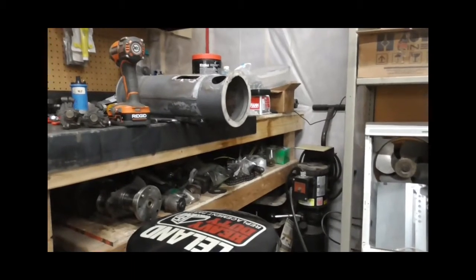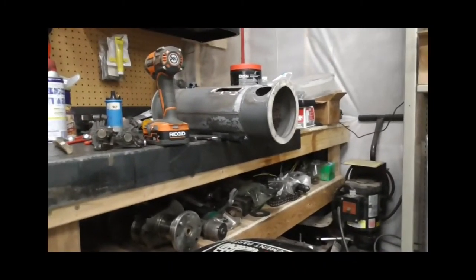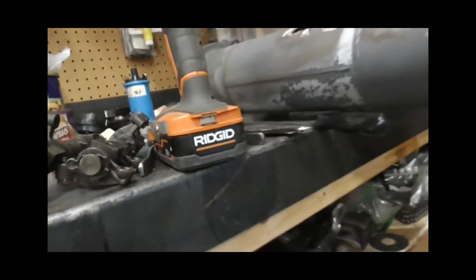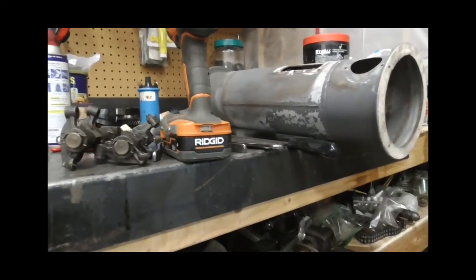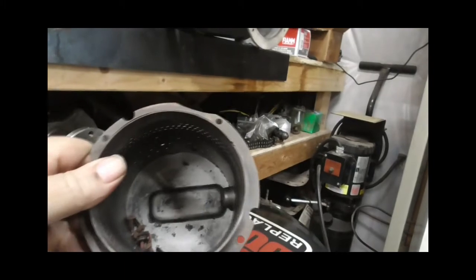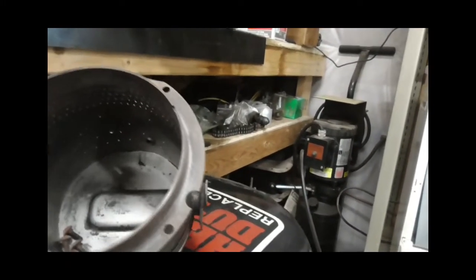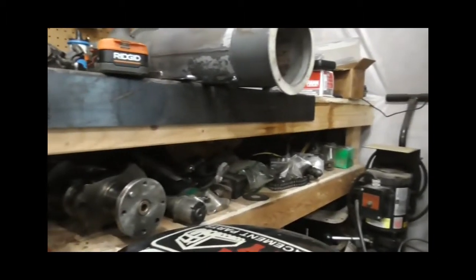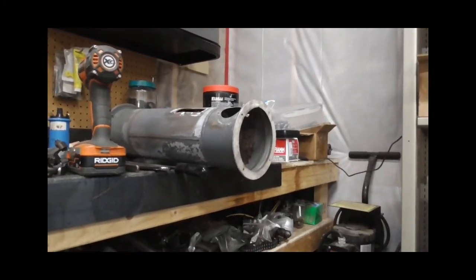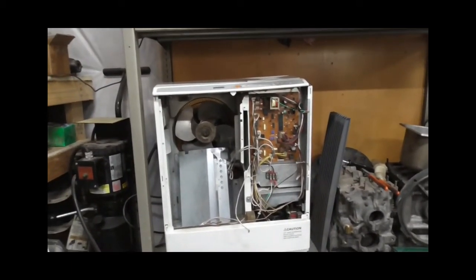Good thing I had a screw gun. There's a mat in the bottom of it that the oil goes down on and burns from there. On these Toyos and Monitor stoves, the mat was burned out, which I guess is not uncommon — it does wear. But I got the chamber out, all cleaned up, and it's in really good shape — no holes, no warps, nothing. Found a guy back east who has the new burner mat and gasket kit, and it was the last one he had for this size monitor, so it's on the way.